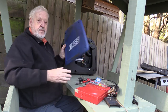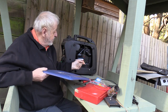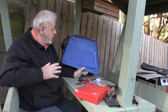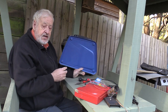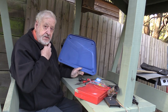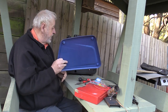This is the first problem. As you can see, this is the ignition coil for the spark, and there's no insulation or ferrites on this rod to stop it radiating back up the wires into the circuit. And if you look at the inside of the plastic cover — it's plastic, not metal. This should have a metal RF shield on it, a wire shield or some form of metallic shield. That shield should be connected to earth, so I will be making a piece of aluminium to fit on here and I'll run an earth wire from it to the common earth on the unit.